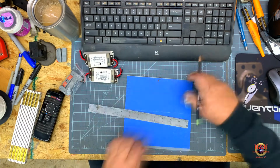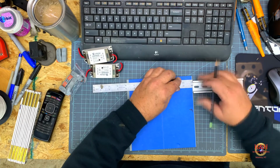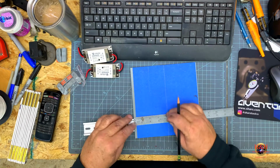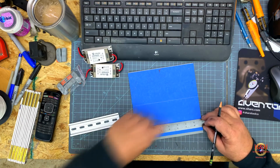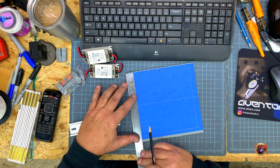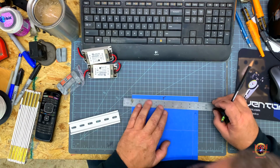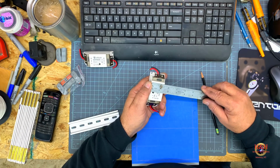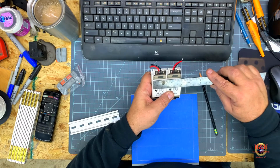Well, I lost the video footage showing mounting the components into the cabinet in the back, so we'll just simulate it doing the ones in the front. So the ones in the front actually have 2 of those Wi-Fi switches in it. And the first thing we do is that utility box has about a 5/8 lip around it, so I went ahead and marked out a 5/8 lip.